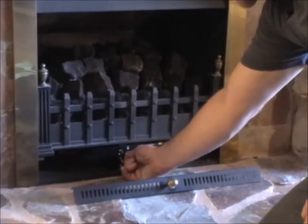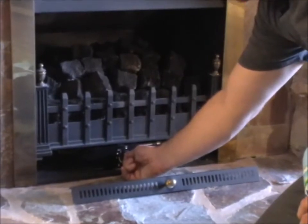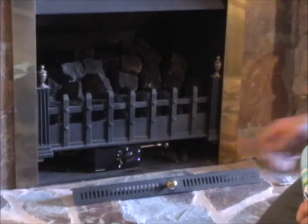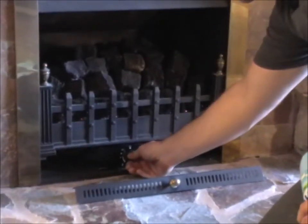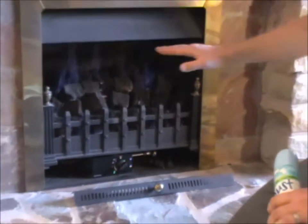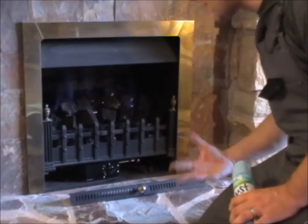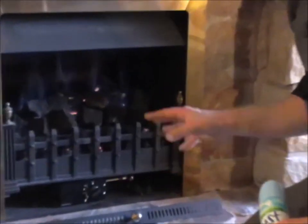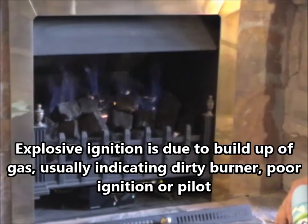Pilot - ignite - hold it down for the heat energy to get to the magnet valve. The pilot light is now on. Small burner. Perfect. The flames are smaller, not so fierce. It ignited a lot better because I actually cleaned all the burners and repositioned all the coals as well. One of the fake coals was blocking the pilot light, igniting the gas and creating that build-up.